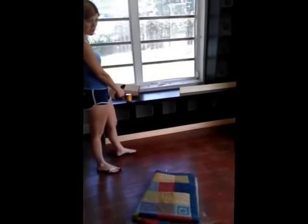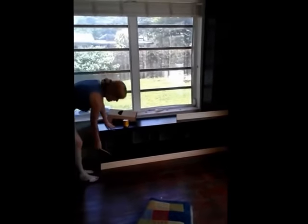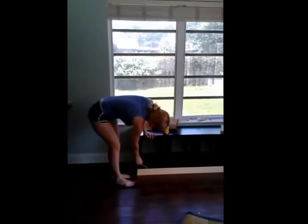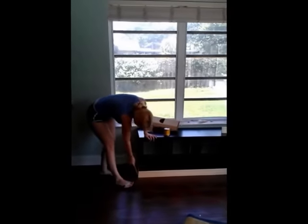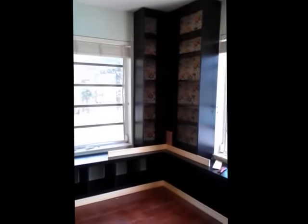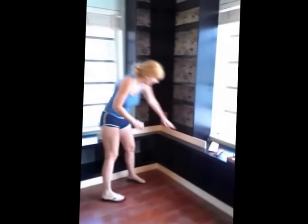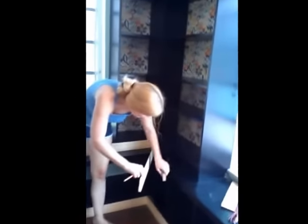We've already done all the bottom molding. We used a 4-inch base form, and that's to cover the feet of the shelves plus come over the top of them. We did our miter cuts on the corners, straight cuts in the back, and the inside miter cut going all the way around to the other side. To make it look more like built-ins, since the Billy Ikea shelves have these inside recesses made for the foot, we don't want it to look like that.